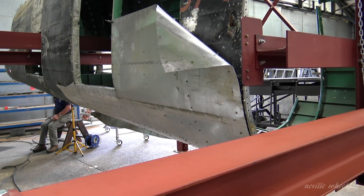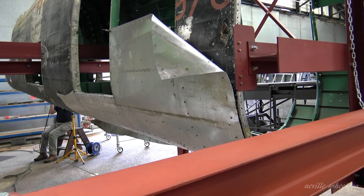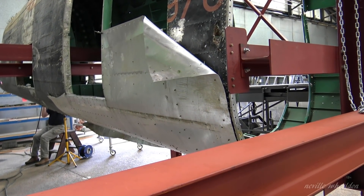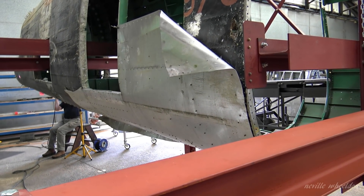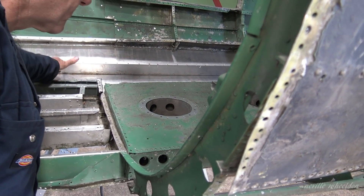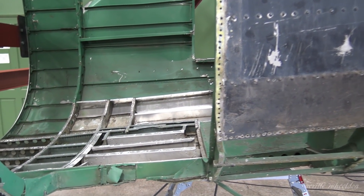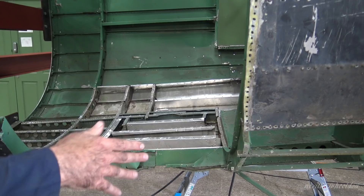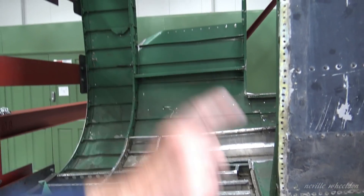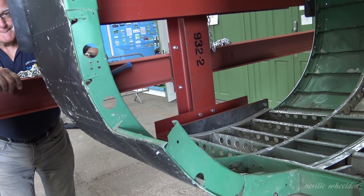And this skin you put on here, is it just to kind of protect it while somebody got to work on it? Well, they did a bit of filming with it apparently, and I think it was done for that, because it looked okay-ish from the inside — from the outside it looked like a bag of nails, basically. There's a fair bit of distortion down here at the bottom. I'm going to take this skin off and make it even more flexible, but it gives us a good basis to go to, to actually recreate it, once we've got nice formers in and nice stringers. It's how they made it in the first place — a beam at the top, a beam at the bottom, put it next to each former, and then put the stringers in. Dead simple.